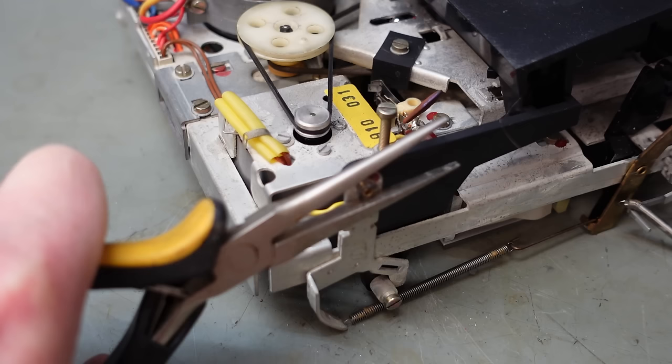I'm going to pick up the scope ground with this lead. Just going to unplug these test leads for convenience. Put the scope ground on there. And just put a crocodile clip on here. Let's connect that to the collector of TR4. Let's turn it on. Oh, minus 4.3 volts.